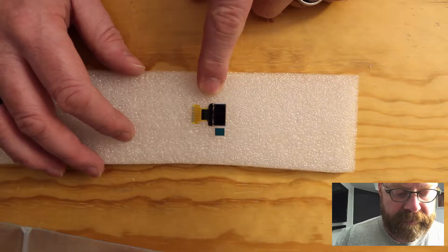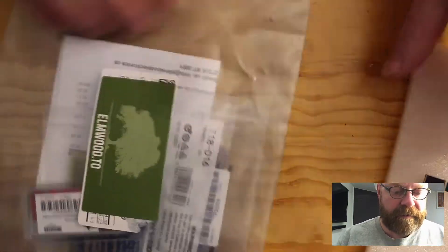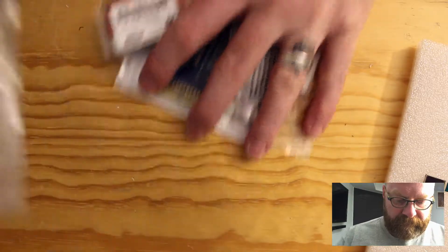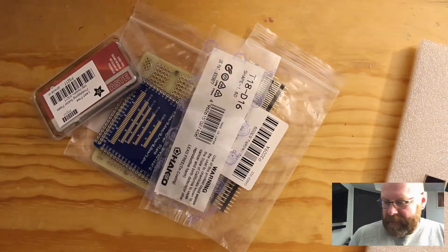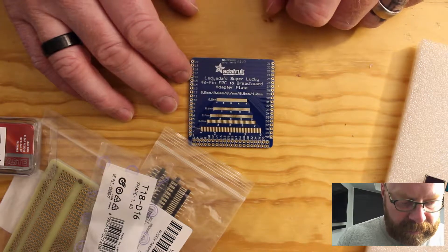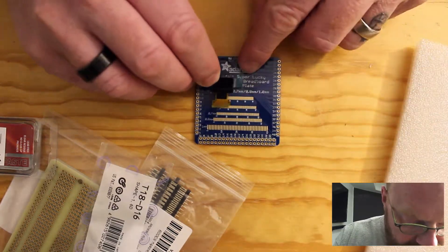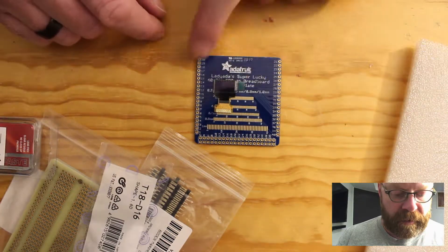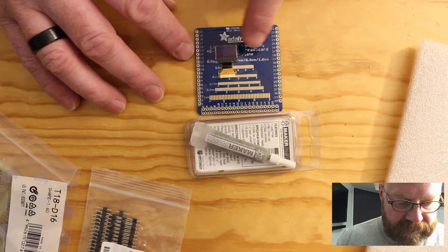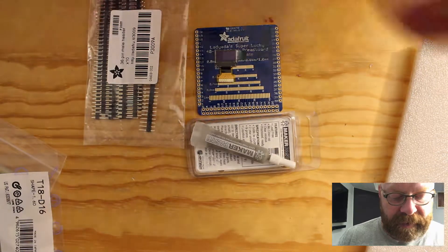This little tiny OLED display is for a project I'm working on for a company called Miniature Land, and it has 14 pins — I'm trying to figure out how I can make that work. The folks at Elmwood and I had a discussion, I came by and bought this super handy adapter plate which has multiple strip distances, and the 0.7 works great. So I'm going to use solder paste on this to mount the OLED display and use some header pins on one bank so that I can talk to it.